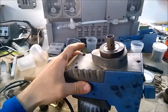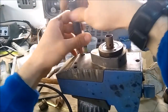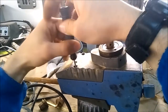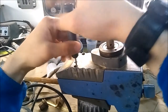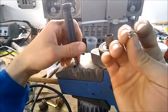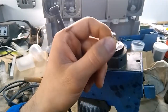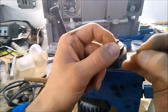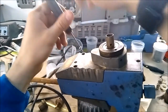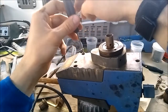Once you get the chuck off, there are three T10 screws. You'll need a proper T10 driver — you can get the front with a bit but the back one is deep enough that you need a proper driver. I'm using M2.5 here because I've replaced the originals with M2.5 316 stainless screws from McMaster-Carr, 10mm long. They're a lot beefier than the originals, and if one strips I can actually fit a screw extractor in there. Plus I'll get a fighting chance of them surviving with 316 stainless.